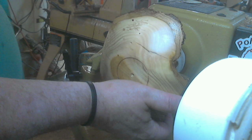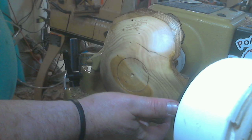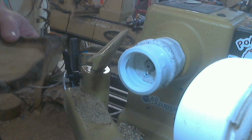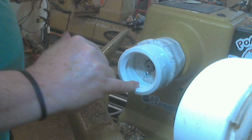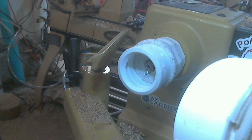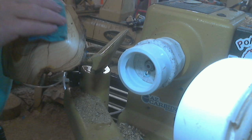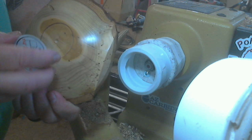Still on there though. That's 10 inches of mercury and it's still on there. Down to 7, down to 5, 3, and it fell off. So for those of you that are wondering how well the Frugal vacuum chuck works, it works very well. You've just seen it. I was spinning it when I was polishing this. I was cutting at about 750, 800 RPM when I did the back, when I was taking light cuts, but I was spinning it when I did the polish at about 900.